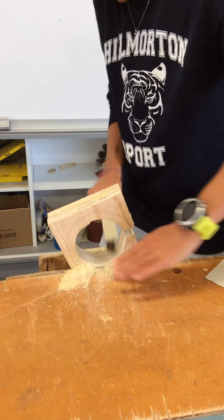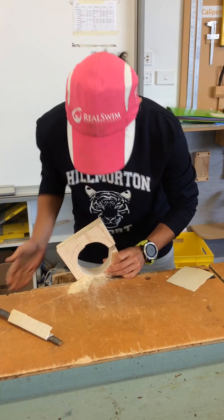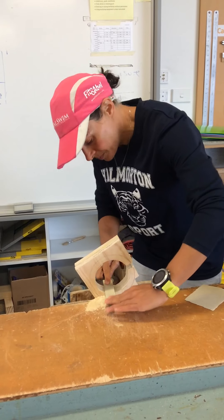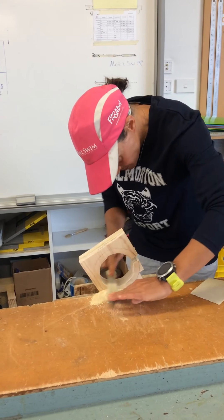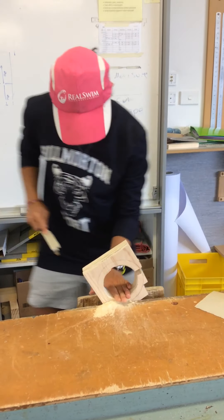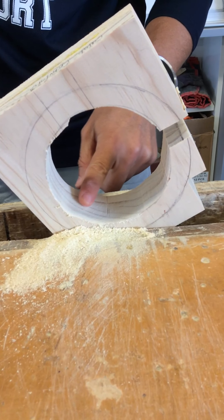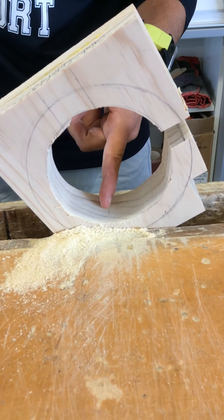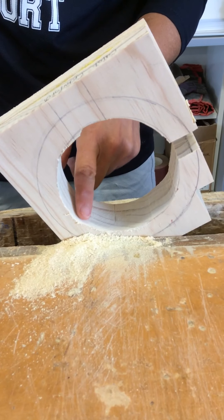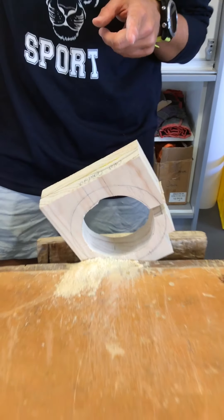How I know when I'm done — in this case I might need to move it up a little bit because I'm getting some interference from the desk. How I know I'm done is when the saw marks are out. What I'll be left with is marks from this sandpaper. Looking at this section I'm working on, I can see the cut marks from the abrasive grit — the 80 grit — but I still have a saw mark which I need to take out. I keep working until all I'm left with is the sandpaper marks and not the saw marks. At that stage I can move down to the next grade of sandpaper.